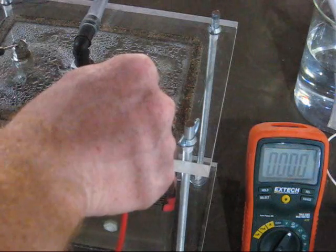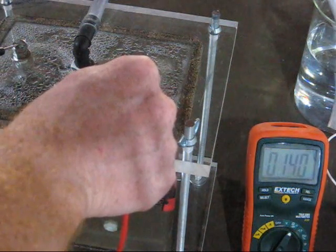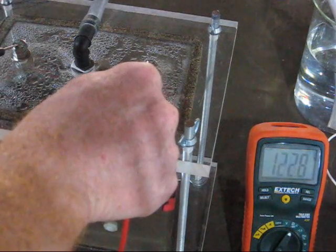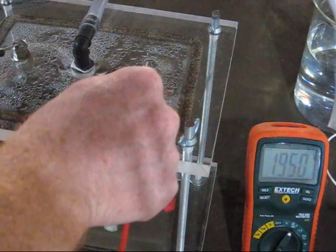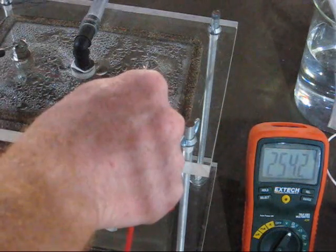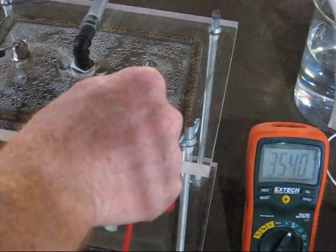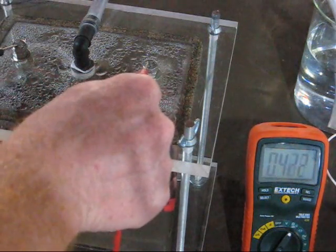One of my theories was that the plates work like a capacitor and I just charge them one direction. Then when I reverse the charge, it discharges into the multimeter and that's why it shows zero resistance. But what I think is actually happening is a lead acid battery effect, because for capacitance you need a dielectric, and we know we've got a good conductor in there because I add an electrolyte to de-mineralized water which allows the flow of electricity. The effect is of a lead acid battery — it charges up, stores it, and then wants to pump it the other way. That's why when I reverse the leads it goes to zero until all the charge is gone and then the resistance starts climbing the other way. This is now already half a kilo-ohm.